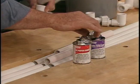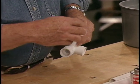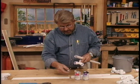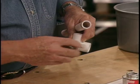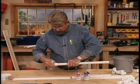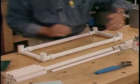So we're going to glue these 2 things together, and we'll be using 2 materials right here. Primer, which is this purple stuff here, and we're just going to go around the pipe twice, inside the fitting twice with the primer. This is the adhesive right here, cement, same thing, around the pipe twice, around the fitting twice. And then we're going to just put these 2 together like that. Give them a quarter turn, hold them for just a second, and our pipe joint is welded. It takes only a matter of minutes to assemble all 3 frames.